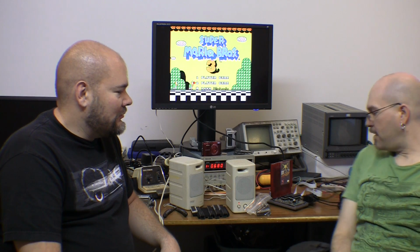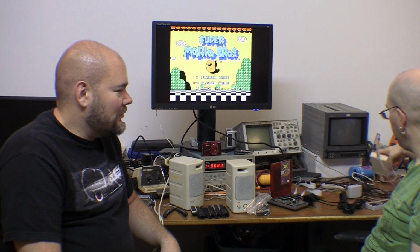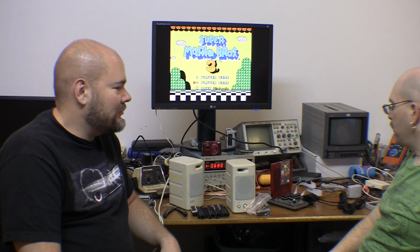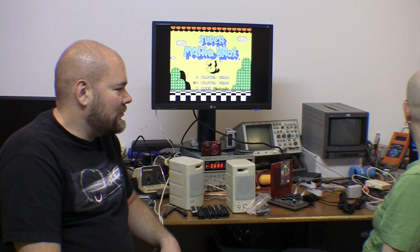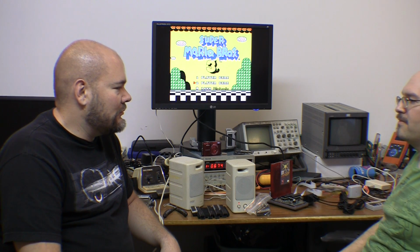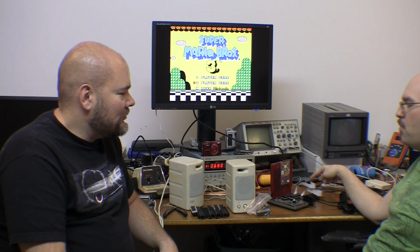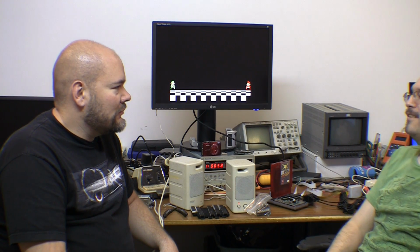So, right now that's what that little 3-pin connector is for on there. It's going to this USB to serial box. And that's how I've been doing it. I did all this menu, things happen, that's how that works. Right. So that's very common, all my projects have that. So, this one's the same way, that's what this is doing. That's the serial debug port, just like that one. So that one works quite well. That debug port's actually connected up to the 6502 on this board. So I guess you could call this a coprocessor.